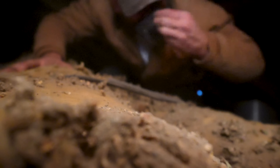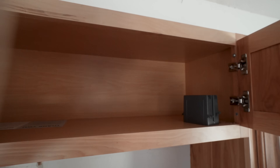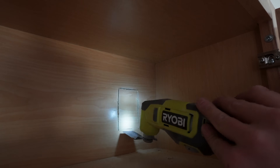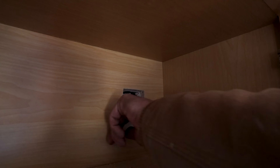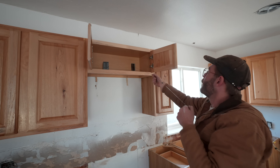You can see I accidentally did a tiny bit of drywall damage — the initial angle I drilled was a little too sharp, but we can work with this with just a little extra drywall repair when we're done. Inside of my cabinet I had a vague idea where I wanted my box to be, so I marked the outline with a pencil and then cut it out with an oscillating multi-tool with the plunge cutting wood blade. When it comes to outlet placement, just make sure there's not a vertical 2x4 stud between the hole we drilled through the top plate and the hole we're cutting now for the outlet. Andy's feeding the fish tape down the wall and I was able to grab it at that outlet cutout.